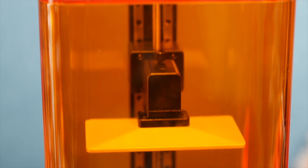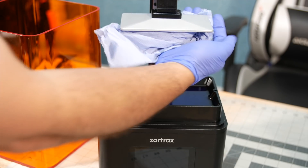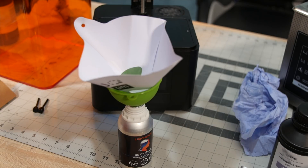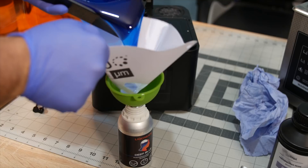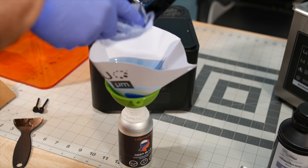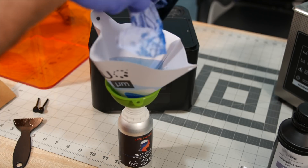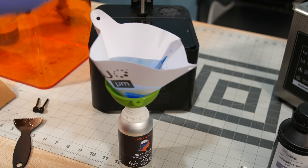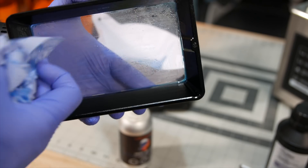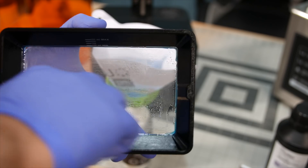While the process is relatively fuss-free as long as you handle with care and wear your protective gear, the one pain point of resin printing for me will always be having to clear out the resin from the vat in order to replace it. You have to clean it, wipe it down with alcohol, then replenish the resin — it's a bit messy. The alternative would be to have several vats for each color resin, but you would still need to maintain those, and you'd still need to spend more money on extra vats.